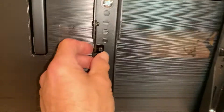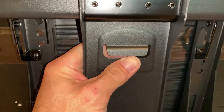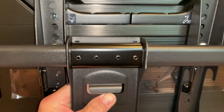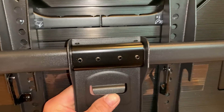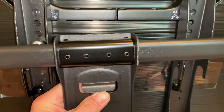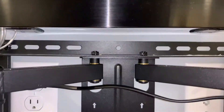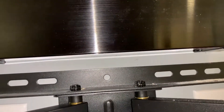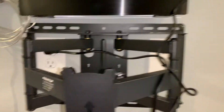This mount has little screws to lock the hanging bar position, so I'm going to loosen those. The center hangs right where my thumb is, and you can only go about four inches at the most to the left or the right to center your TV. Luckily mine is already pretty close to center. My center TV mark is to the right of that hole, so when I put the mount on the back of the TV I've got to consider that and push the mount offset accordingly.